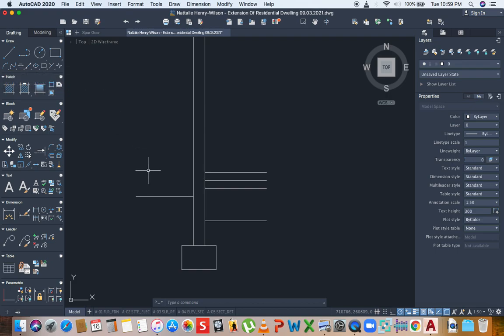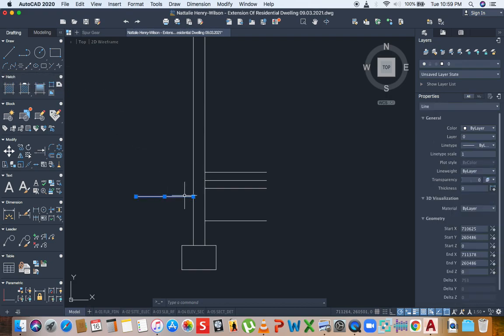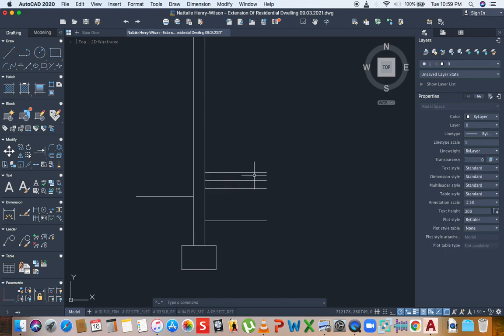All right. So this is the ground level right here. This is the floor level. This space here is the concrete slab that is serving as the ground or the floor. Below the concrete slab, you have sand that is acting as the sand blinding. Below that, you have the hardcore layer, and I'll soon explain what the hardcore layer is. So we are getting there.